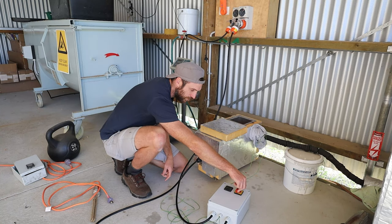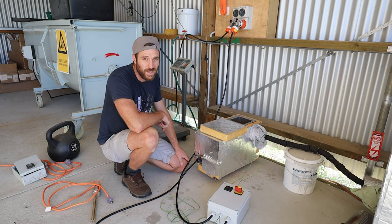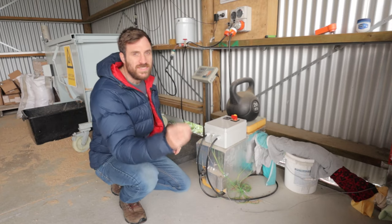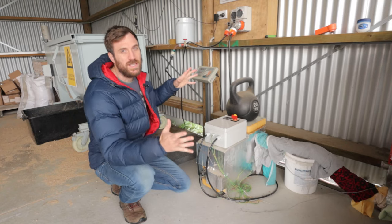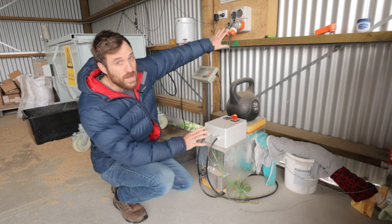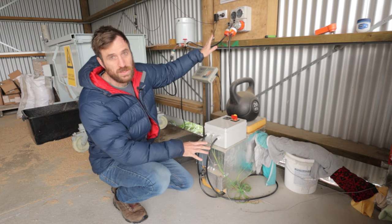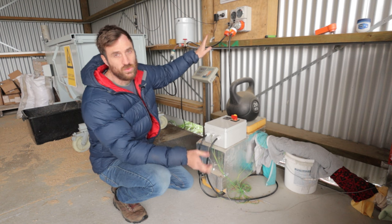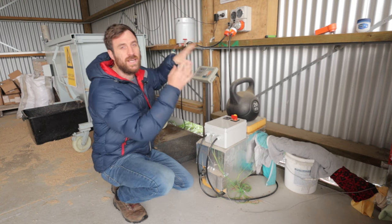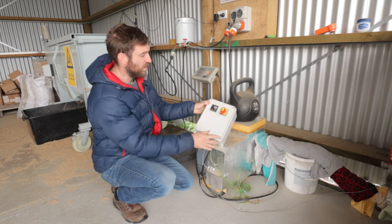So I just need to make sure the Omron is functioning right - it's plugged in at the wall up there. I flipped it on and it blew the breaker. Since that last clip, it's actually been a couple of months. What had happened is they'd wired the power for this into the three-phase breaker - because it's on three phase, all the draw was coming through a single phase and just popping the breaker as soon as I turned it on. I had to get the electrician back in to fix it, which he did - he rewired it.